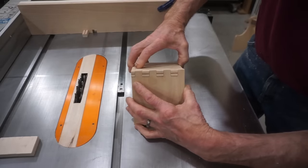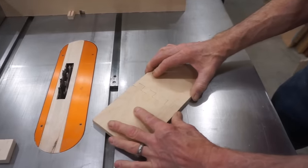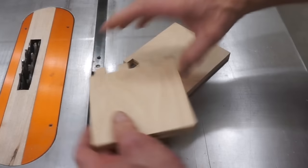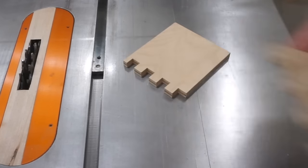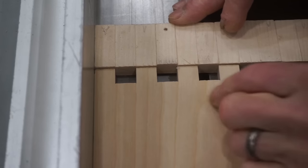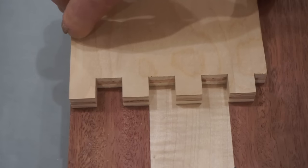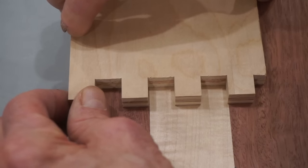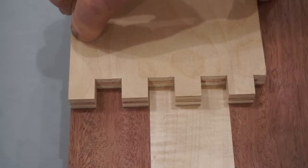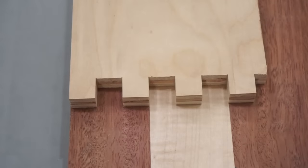At first glance, that does look like a pretty sweet fit, but if you look a little closer, you can see that there's a bit of movement in the two pieces, which in some cases probably isn't that big of a deal. But on further inspection, you can see that the pegs are losing ground when compared to the gauge blocks that are the benchmark for layout of the tool tote project. And I fully agree that that really doesn't look like much, but it's enough to make a difference when the test block is placed on one of the side pieces for the tool tote, and you can see that the notches don't line up with the accent stripe like it needs to on the finished tool tote.